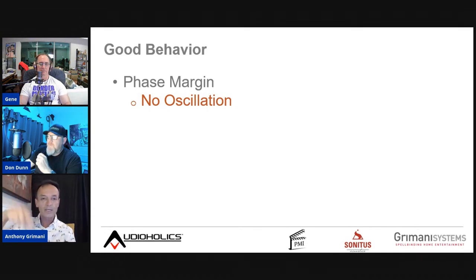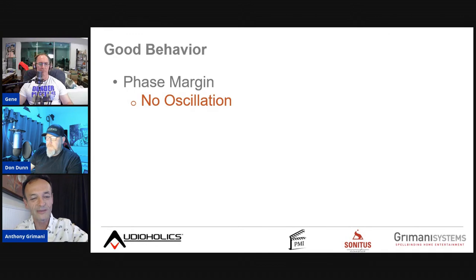A speaker, when viewed from the amp's terminals, looks like a combination of resistors, capacitors, and inductors — a tank circuit. In certain conditions that load can cause oscillation. The amp ends up generating a 1–2 MHz signal you can't hear, but it chews up power. Changing speaker wire can fix it, not because the wire is magic, but because it stops the oscillation.